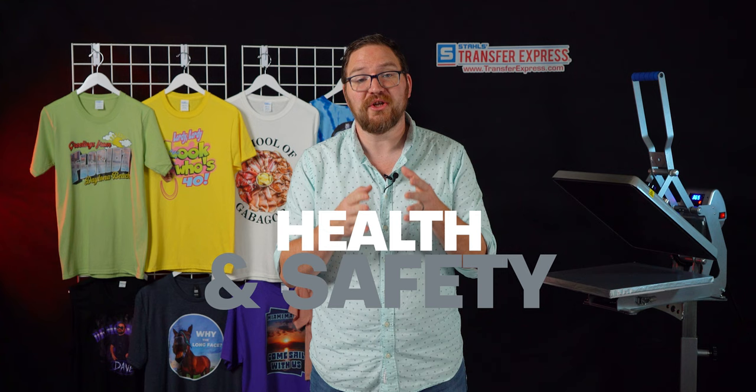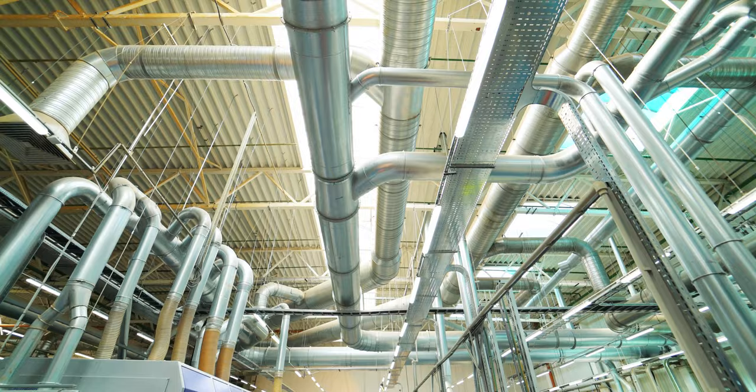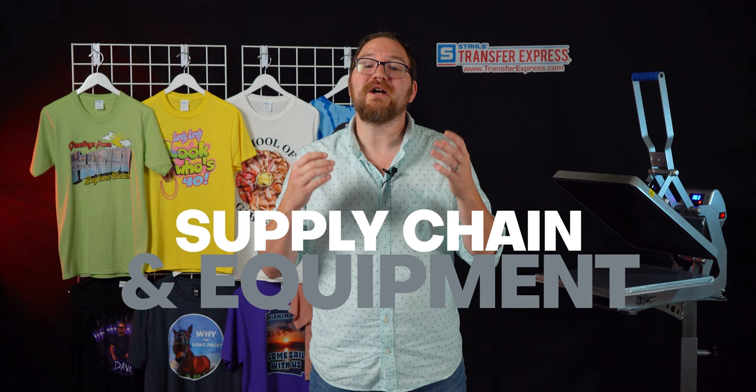Next up, we have to talk about the health hazards you're going to introduce into your workspace. Curing adhesives can produce some harmful chemicals. For larger shops with proper ventilation systems this might not be a huge issue, but for small home-based businesses or t-shirt brands running out of a garage, this could lead to expensive and loud vent systems to keep the hazards to a minimum — not to mention exposing your family to this stuff. Even small desktop units may require proper ventilation or personal protective equipment for your health and safety.